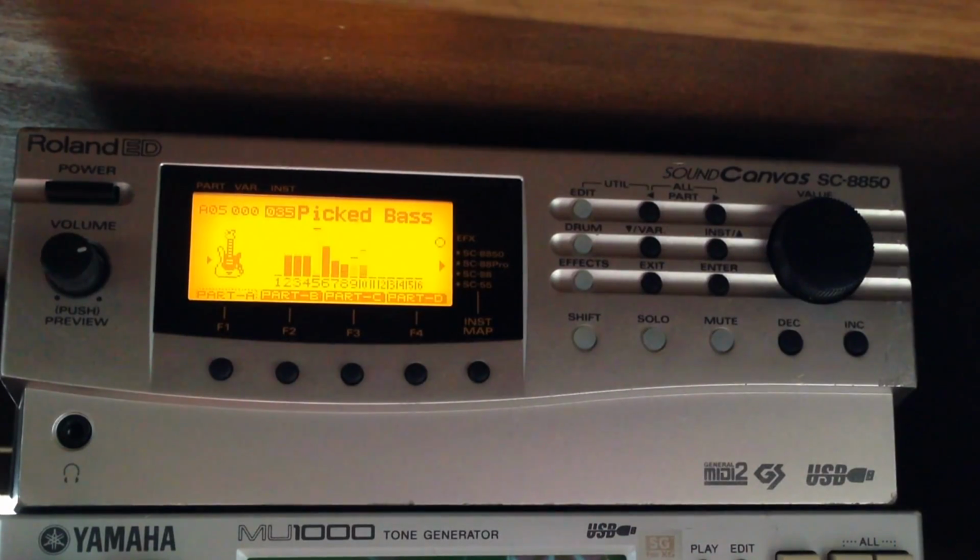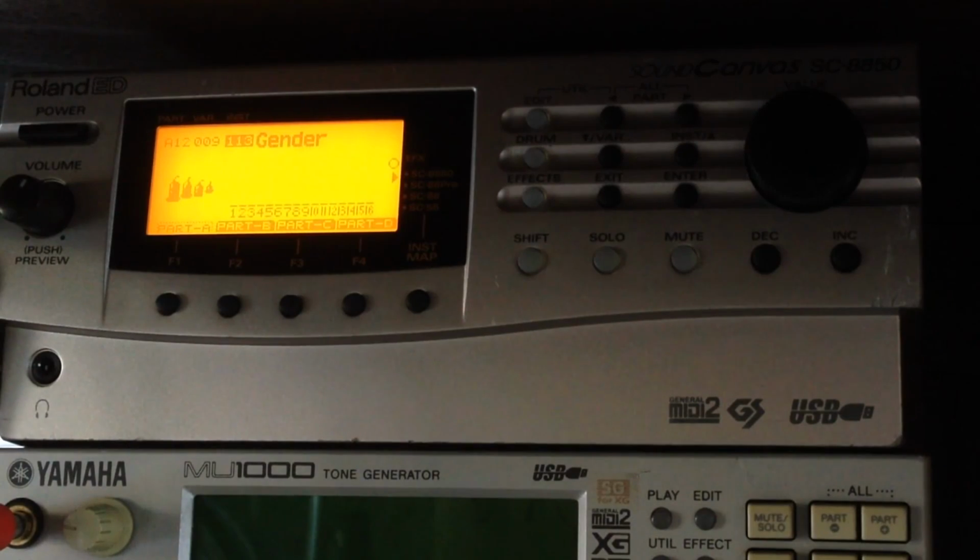Contrary to what a lot of people think, the Sound Canvas family does a lot more than just playback samples and software. The CPUs have to handle synthesizing sounds, mixing ones that use multiple samples, altering them with filters and envelopes, and other odd bits like the automatic legatoization of instruments like the violin. Porting all of that code, or really any large amount of code, from one architecture to another is almost always going to result in something going weird or not behaving as intended,